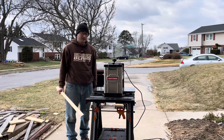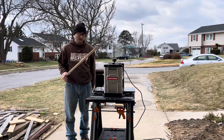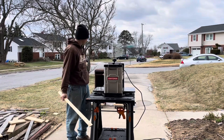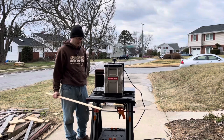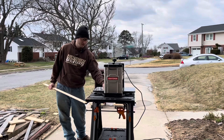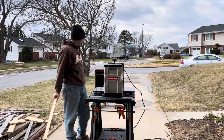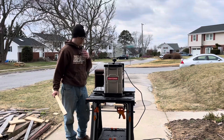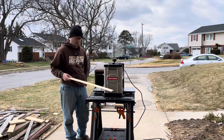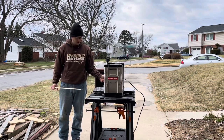They're on the inside. The wood around it is stained plywood, so a perfect match in this situation does not really matter. What matters is that the color is pretty close. Grain pattern, not a huge deal. So yeah, I'm gonna plane this down to 1/4 inch. Okay, let's get going.